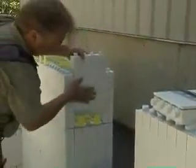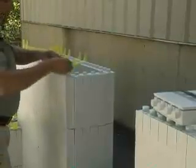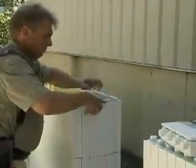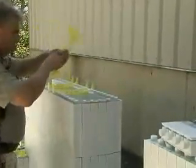For maximum energy and material efficiency, use panel offcuts and metal window brackets to form door and window openings. This method reduces wood consumption and the potential for thermal transmission through wood members used in forming buckouts.